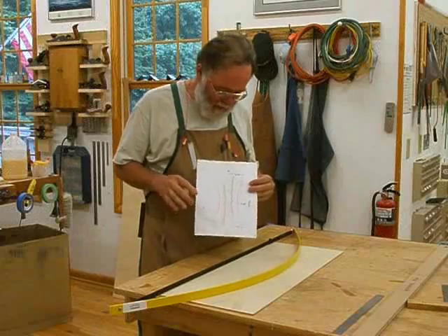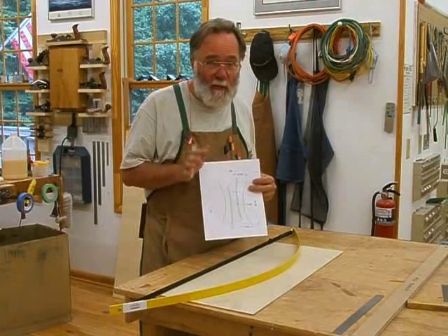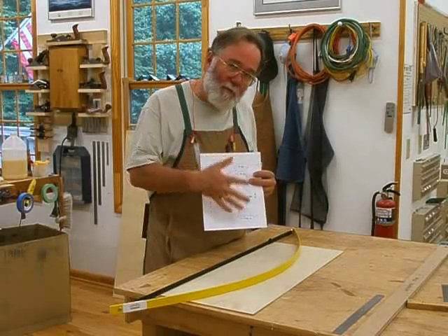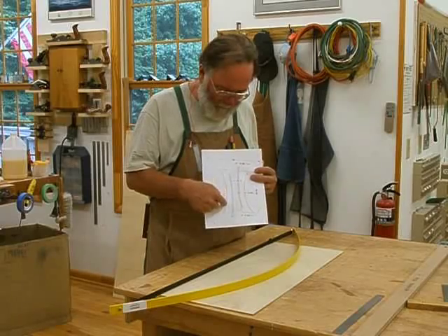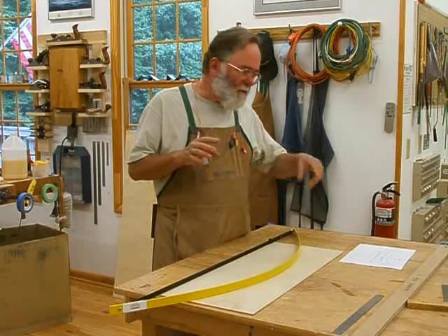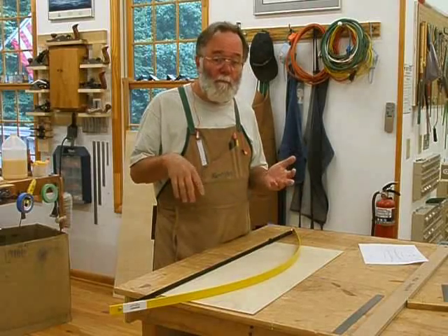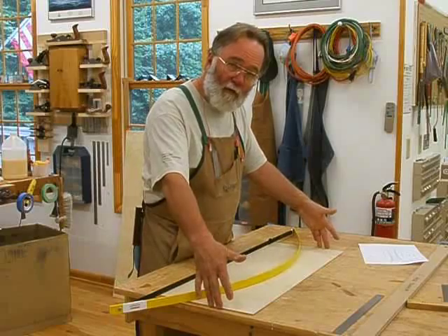The pedestal portion of this table is made of four upright pieces of one-inch thick maple. This comes from the same tree that my client had me use for a desk and a mantle. Same client, same tree. We're trying to use some of this solid maple for these uprights, which have a curve in them. I've taken a single plank that's ten feet long and cut it into four pieces, so all four pieces will have the same grain characteristics and coloration. Now I'm making a template to draw this curve on each piece and get them all the same before I bandsaw them. I've taken a piece of eighth-inch plywood, squared it up, and cut it to the right length for the template.